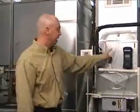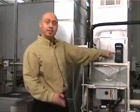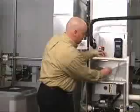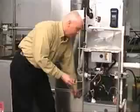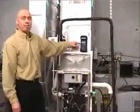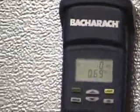That is an actual false positive reading because he did not take into consideration the coil or the filter. What looks like a good number is in essence a very bad number — it's very high static pressure. If he were to actually put his probes in the correct location, between the coil and the furnace and between the filter and the furnace, you will see the actual static pressure is not 0.24 or 0.23. The actual ESP — external static pressure — for this piece of equipment is 0.69, almost 0.7 inches. So it's way higher than the allowable level.